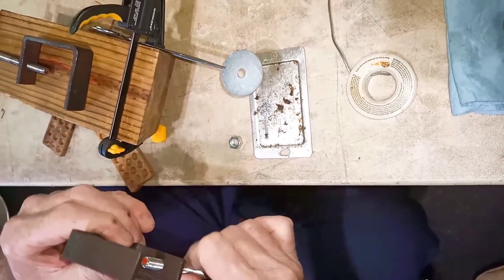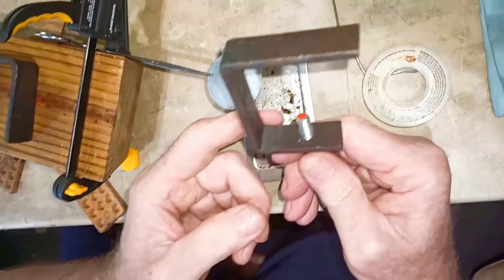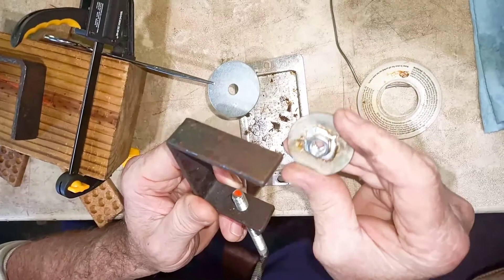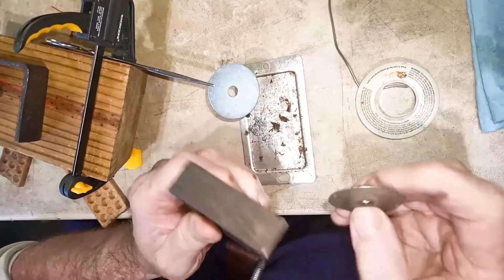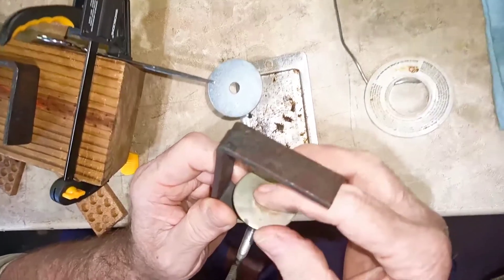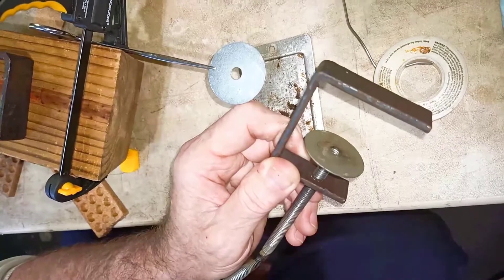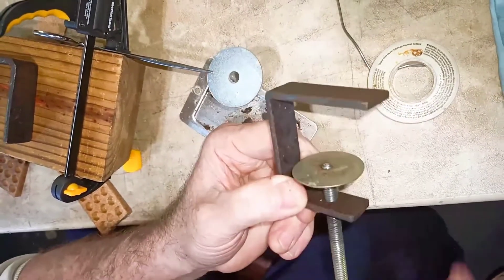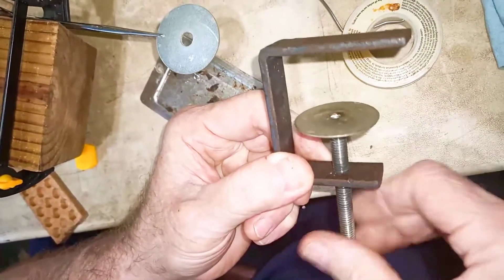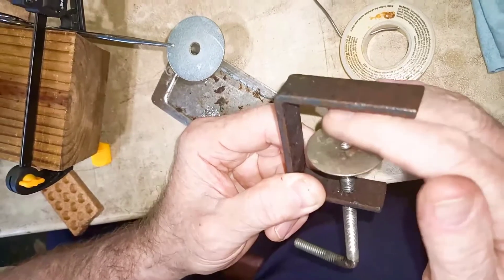What we had was a cute little brass end to go on it, but we lost it, so I've just made this one. Frame washer, 3/8 nut — and you'll notice it'll screw right down on the rod, like so. What you do is just barely start it. We're going to clamp to the table, and you'll notice this spins very, very freely, so you know without looking when you get to the depth of the table.